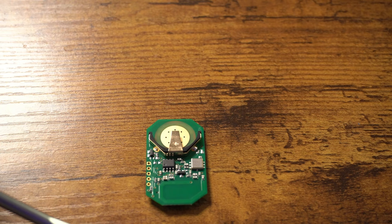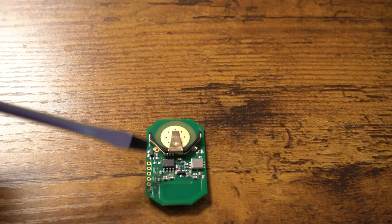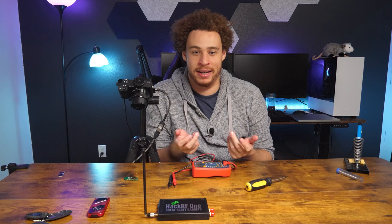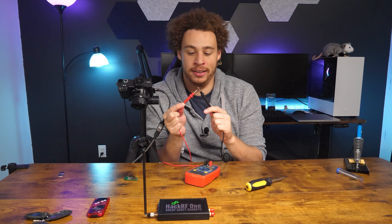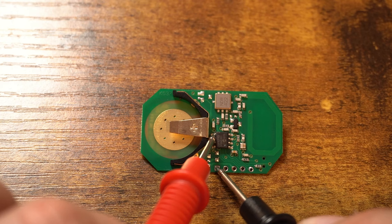So all we need to do is figure out the pin-out of this header. There are a couple of ways to do this. The first is by tracing the pins — you can follow the traces on the circuit board from the chip to the header, but the traces can often pass through the middle of the board and come out the other side. My preferred method is using the multimeter in continuity mode, which causes one lead to emit a small current and emits a tone when detected by the other lead. Since the header is for the programming interface, all pins should go to legs on the chip, so we put one lead on a pin and go down each leg until we get a tone.